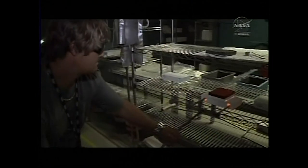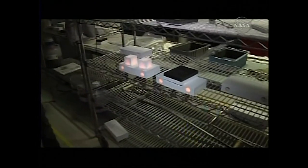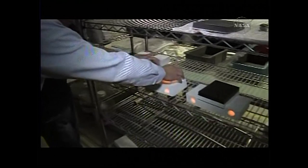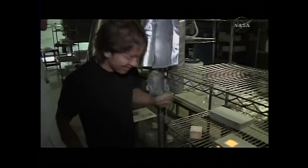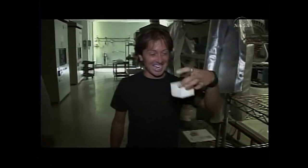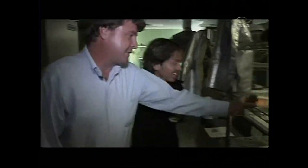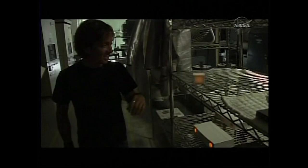The tile is at 2,200 degrees, and you can see how the black coating starts to cool very, very rapidly. This is just raw, uncoated material — look at them, they're glowing inside. But you can actually go ahead and pick them up, just by the corners with the lightest of pressure. It's still 2,200 degrees in the middle and will burn you if you're not careful, but it's silica — very low density — with a relatively low heat capacity, which is the only reason you're able to do that.